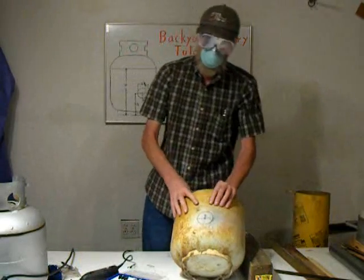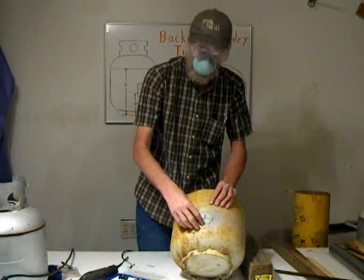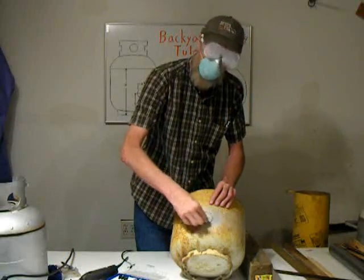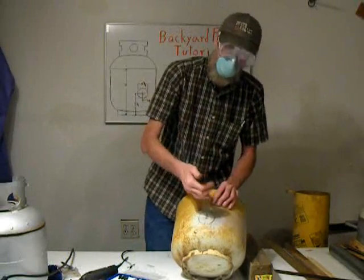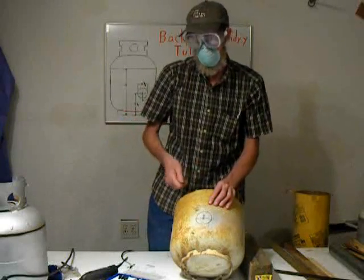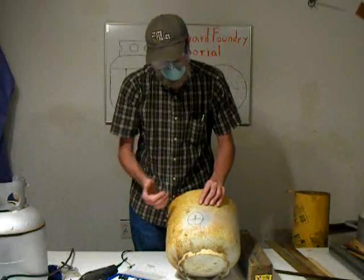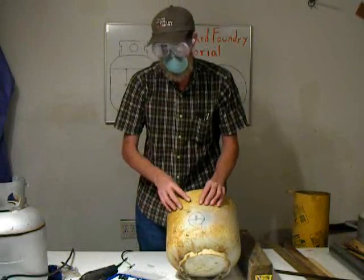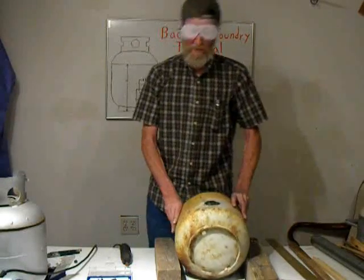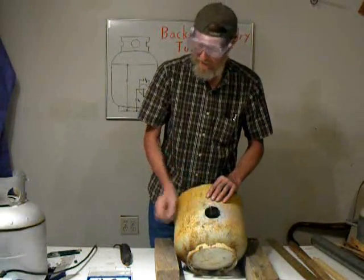And as you can see, just do a series real slowly all around the marked line, getting a cut started, and then you'll plunge on through to the inside in stages, so you can get the pattern set and it won't tend to jump around on you as much, and make it much easier to cut a fairly decent hole. Now here we have the hole cut. This did a pretty good job. It's got a little rough edges.